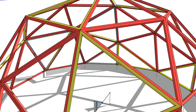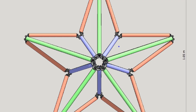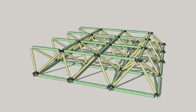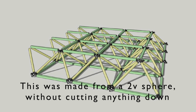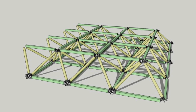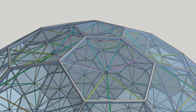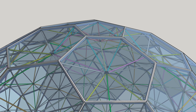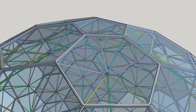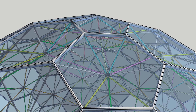With wanger flanges, if you don't want to keep a dome forever, you can recycle the joints and make another dome or even a totally different structure. If you build a two-frequency dome with bevel frame, it'll never be anything else. With wanger flange you can take it apart, reuse the strut material — even cut it to different lengths — and make something totally different. For higher frequencies like four, five, or six, wanger flanges on a single skin put huge stress on the joint, but you can build those frequencies using a double space frame truss construction. You can actually build bigger domes than with beveled frame, though beveled frame is probably better for medium-sized domes.